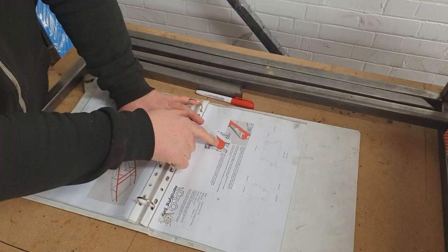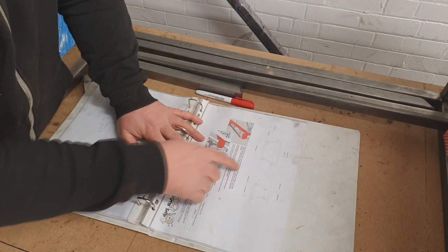That's not the only thing. I'm going to be adding a lot of strength, not just in this one bracket that it tells me to do, but in all the others as well. Quite simply because there's going to be a bit more weight than this is designed to take. Now if we start digging into these sizes here, you'll see that there's a number of projections from a number of different places — namely the absolute base of the car and the absolute front of the car. That's what we're going to use to work out exactly where these upper brackets need to live.